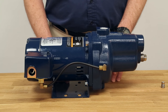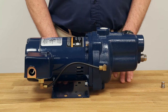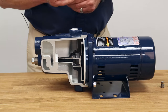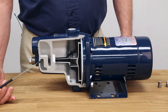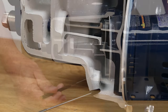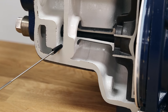Now that the body of the pump is drained, there is still water in the discharge and suction lines. This can be blown out with an air compressor or drained by gravity through the pipes — we must get the water out or it will freeze and could break the piping. Let's turn the pump around and look at the panels inside to see why we will probably need to add some non-toxic antifreeze. Note that the cavity extends below the drain plug that was removed. If water gets trapped in there, it will freeze and could break the casting. Tons of pressure can form from these small amounts of water when ice freezes.